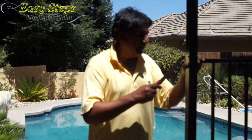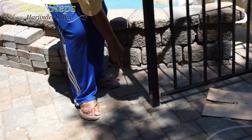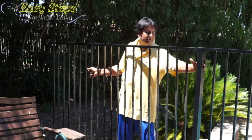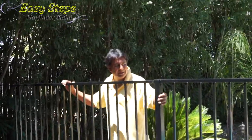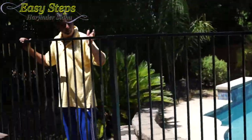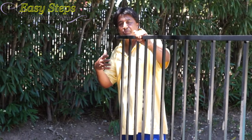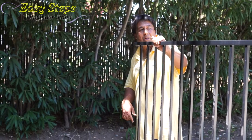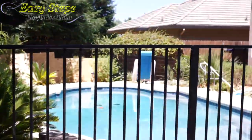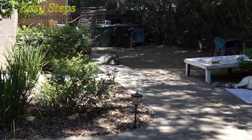I'll make sure these pavers are removed and dig a hole for panel number four — this one slides right in. It looks a little wobbly here and there, but only because we haven't poured the concrete and the bottom bolts haven't been put in yet. I'm going to dig another hole and bring the final steel fence up to complete the fencing, then finish up the gate. Look at how beautiful it's already starting to look! Sheru and Bruno are relaxing down there in the shade.